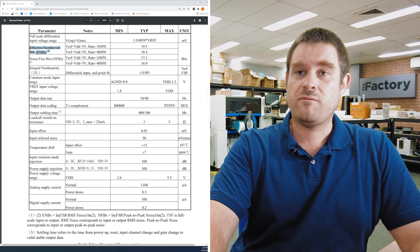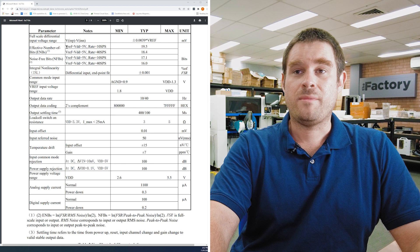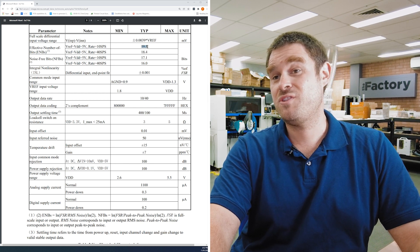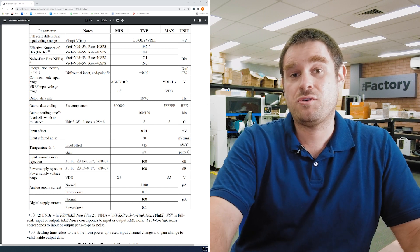There's a non-trivial number of bits of noise — we're going plus or minus 128 roughly, so around seven bits of noise. Now we might be thinking that's terrible, wasting seven bits out of 24, but it actually turns out not to be too bad. Running the numbers on this noise level, with the current implementation it's got an effective number of bits of about 18 bits. The datasheet for this device specifies an effective number of bits of about 19.5 bits at 10 samples per second with a 5V reference.